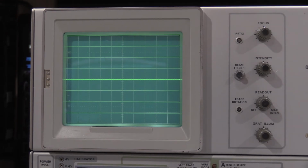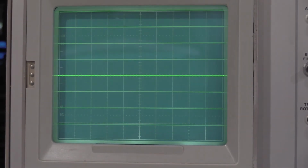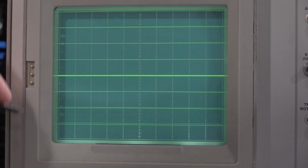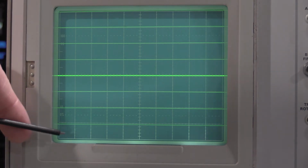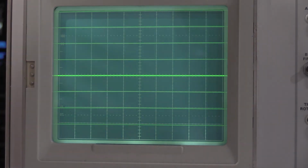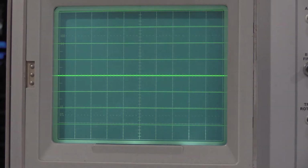Okay, I have everything set up for the vertical amplifier gain. Zoom in on the screen here real quick. As you can see, for this one we check between the 2nd and the 8th division, here and here. You line up the bright trace in the center and then check the deflection. It's 0.006 divisions, so we are a little off here. Not much, little. So what we'll do is we'll see if we can't true that up. It is R06 on board 44.